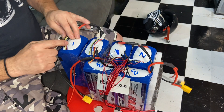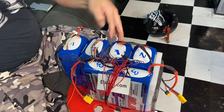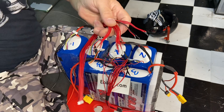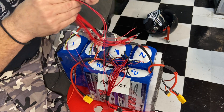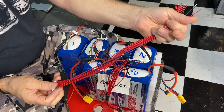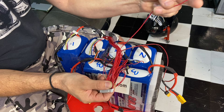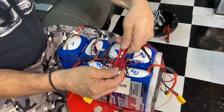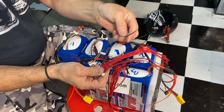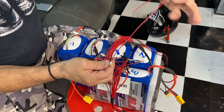Let me show you how to do one to two bricks, and then you just do two to three. I already have my leads spliced and ready. This one here has 18 wires, but we're only using 17 — we're going to leave off the last one because for 16S, this BMS uses the black wire for zero, then it goes one through 16. Just leave this one off.